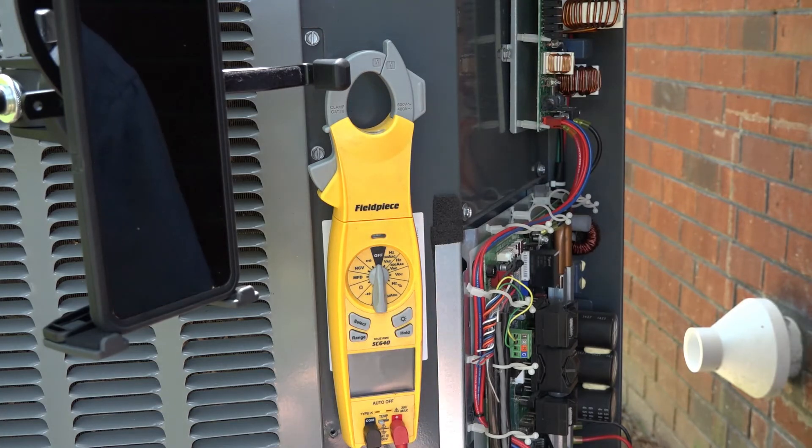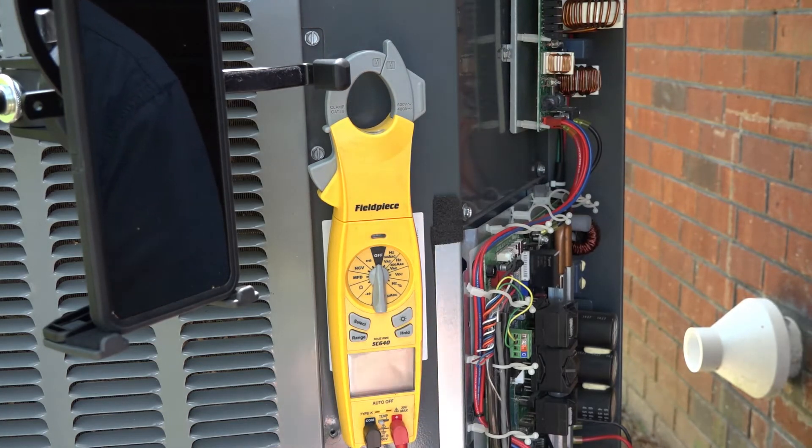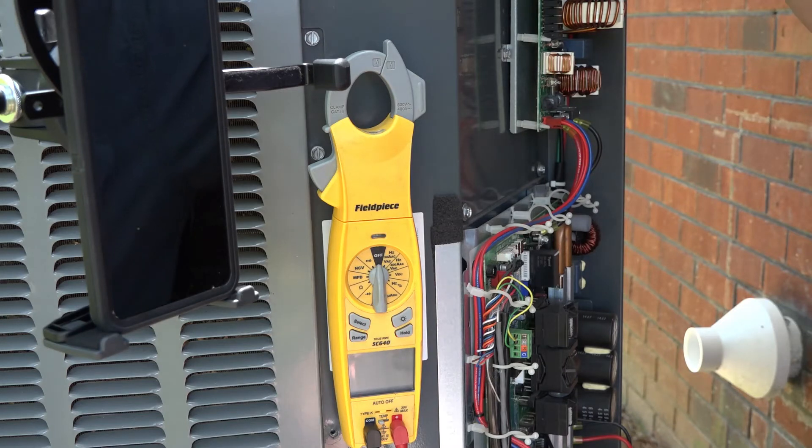Then I can throw the power back on. It's going to take between 10 to 15 minutes for the thermostat to renegotiate and talk to both the indoor and outdoor boards. And then you've got what they call a Daikin five-minute time delay relay built into these boards, which is actually about seven and a half minutes — so yes, it is a long five minutes. If you have any questions, please reach out to me. If you like this type of video, like and hit subscribe to the channel and we'll see you soon.